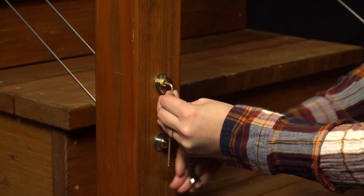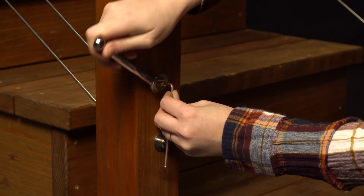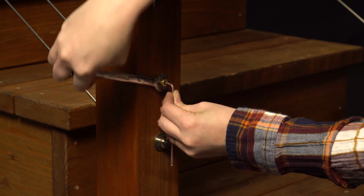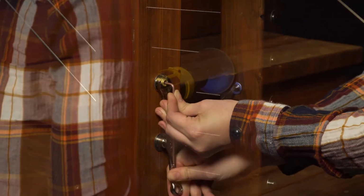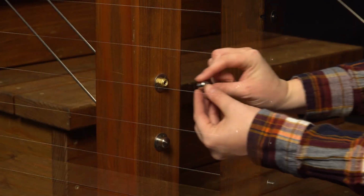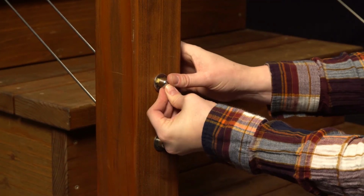If tension has diminished slightly as a result of the bending of the cable, retension the threaded stud back up to desired amount. When all of the cables are tight, cut off any exposed thread as near to the lock nut as possible by using a cutoff wheel or hacksaw. If you have purchased the optional nut cap, press the cap over the lock nut.